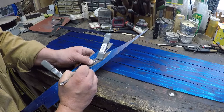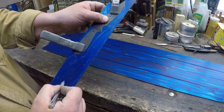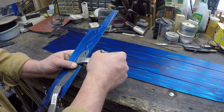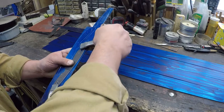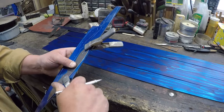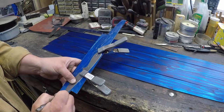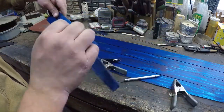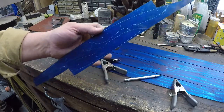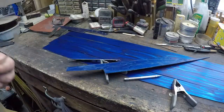And then the really little itty bitty scraps, you think you got scraps that are too small, like these little pieces that are going to be in here. You'd think, hey, that's too small, you couldn't make nothing out of that. Well, heck, save them anyway, because if you forge, you can always stick them into a can as filler when you make canned Damascus. Okay. So there we go. We've got three scribe patterns, 3/32, 1095. Let me grab my earplugs and some safety glasses, and we'll go over and cut them out.